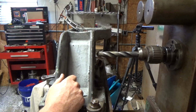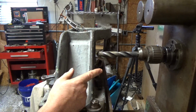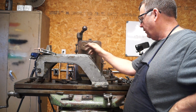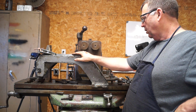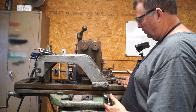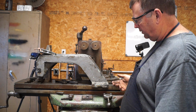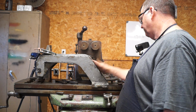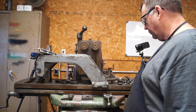We'll see. We don't have a whole lot of room, so I need to get a chuck key and tighten this drill chuck up. Our 1 inch didn't work too well. It wasn't cutting like I like, so I've dropped the drill size down. We're going to pop 2 holes in it, then we'll go back to the 1 inch. So I've reset up. I've actually moved the whole part over. It's something I wanted to do anyway, and I should have done it before I started the last time. So we've got it all indicated back in, fastened back down, and we're ready to go.